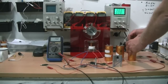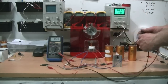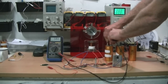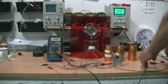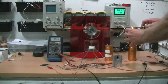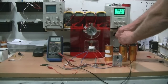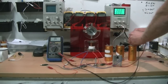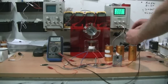So what I'll do is I'll put our 30 volts in here, get our meter. We'll just check these 2 here. I've got 59 millivolts in that one, and I've got about 600 millivolts in that one. For some reason this one cap recovers really well, gets a bit of recovery voltage. As you can see, 11, 12, 13 millivolts. So it goes up to about 600 and stops anyway. So we've got our 30.6 volts in there. So just keep an eye on that number, 30.6.